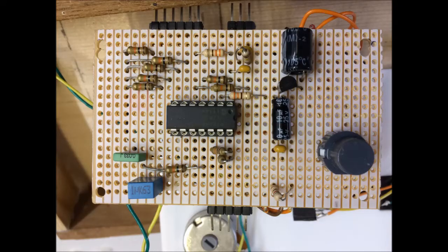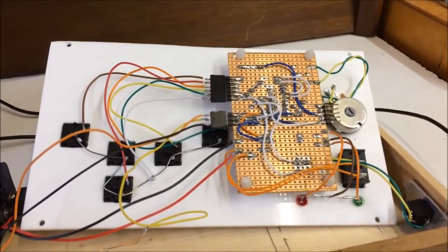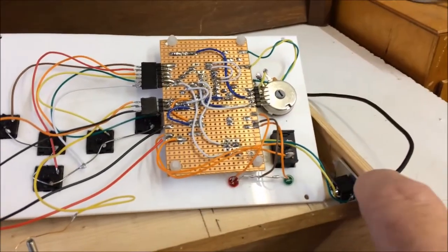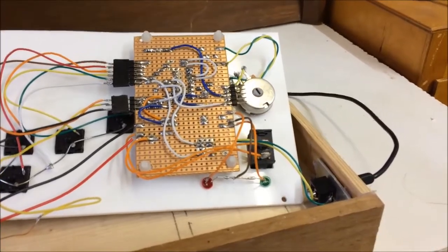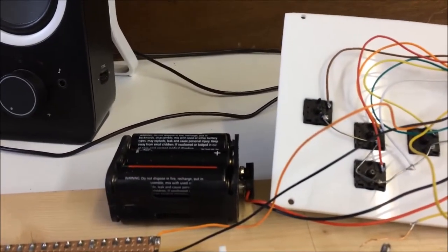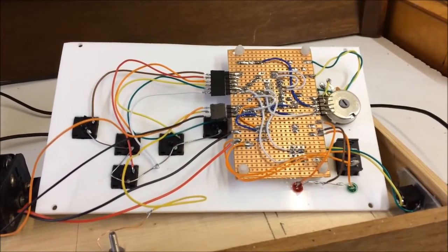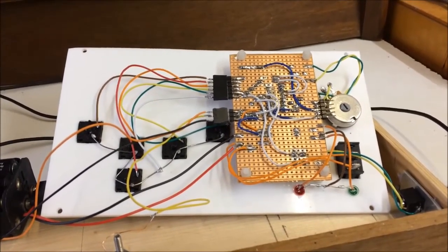Here's the main circuit board and wiring. It's fairly simple, with not too many components. There's an audio out jack socket on the side, which goes to a set of PC speakers, and at the moment I have the unit powered by six AA batteries, although it will run just fine on a 9V battery, as the current draw is around 10 or 12 mA.